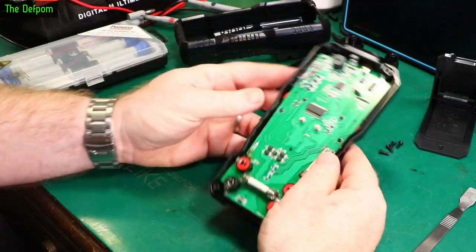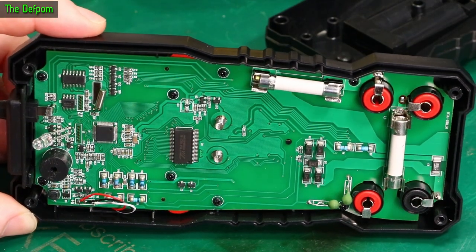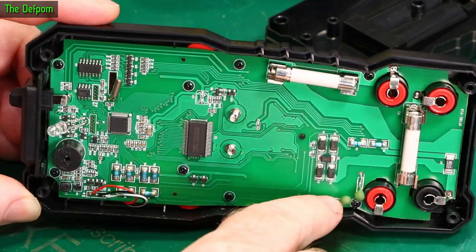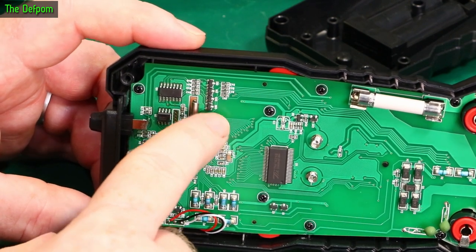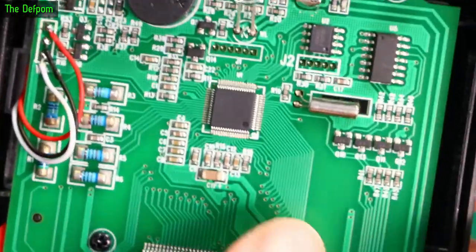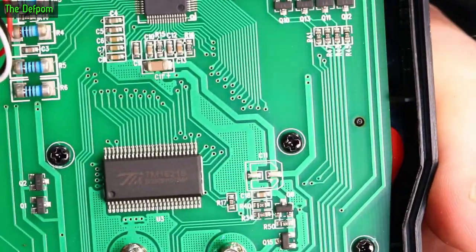There are battery terminals, a couple of spring terminals for the connections, and two fuses — ceramic fuses, surprisingly. That's what the inside looks like. There are some diodes down here for the protection system, input resistors with very low ohm resistance — probably the sensor resistor for the 200mA range. Got the PTCs, a little buzzer, and a crystal which is floating around and getting close to touching a transistor leg — that needs tacking down.